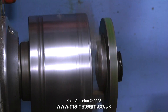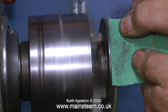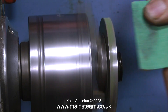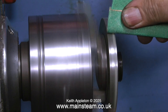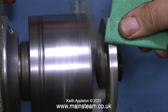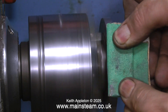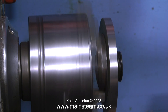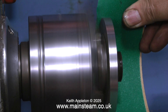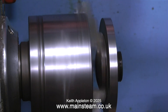Now it's time to put the lower cylinder cover into the lathe and use some sandpaper to clean it up. Here's another example of why I use cheap sandpaper for this sort of job — it's made of stiff paper and the more you fold it the harder it gets, almost like a multi-toothed lathe tool. By doing it this way I can keep my fingers clear of the rotating workpiece and chuck jaws. I'm starting with 80 grit sandpaper and then changing to 120 grit to get a finer finish, and this clip also shows me cleaning the underside of the lower cylinder cover.